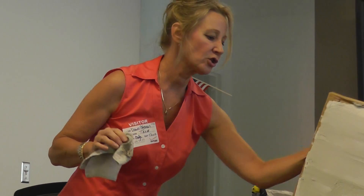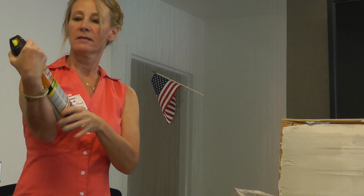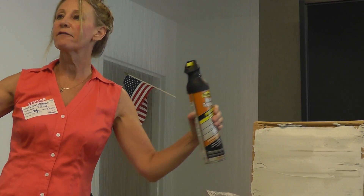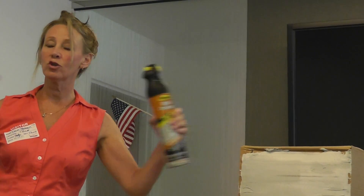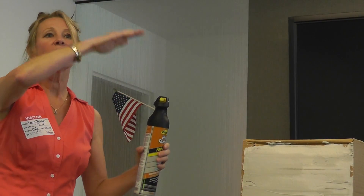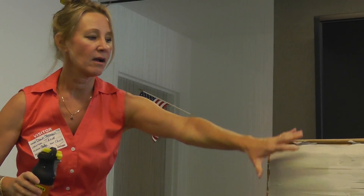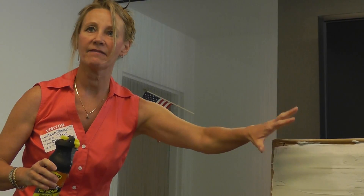Remember, you're going to use your texture on it. Once it dries and becomes smooth, you take your HOMAX wall texture and just spray it. Less is more — if you look at the surface of the wall and put too much in one area, it's going to look like an ant mound, which is not what you want. You just want to cover the area but not have it solid.